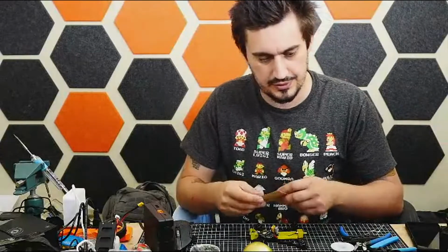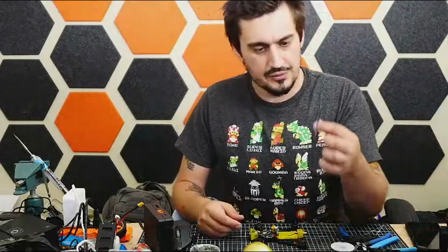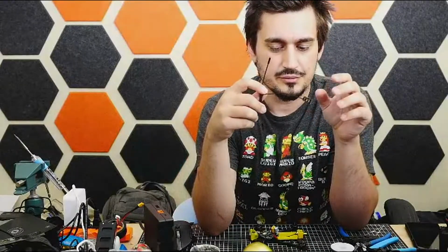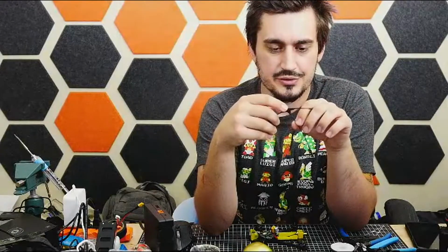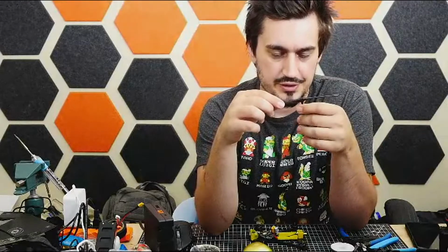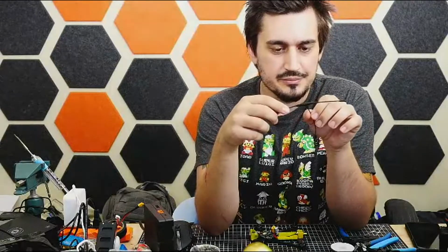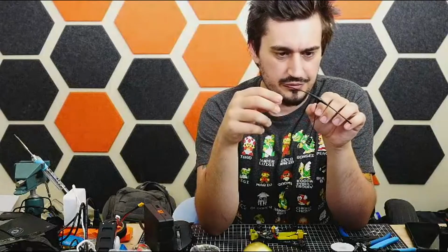Cable set, we don't need that. This is the video, the receiver for the RC link. This is a TBS Crossfire. It works on 900 megahertz in the US or 866 in Europe. Pretty long range on this thing, maybe around 20, 30 kilometers. Slightly less in freedom units.